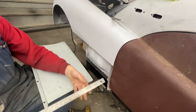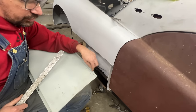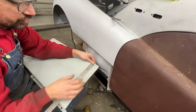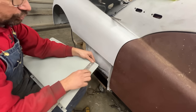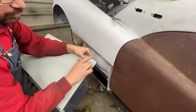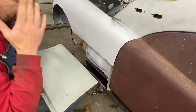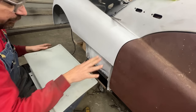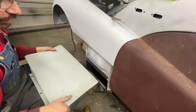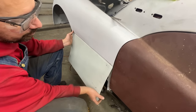It's cut off. I measured from where the old fender needs to overlap the patch - 12 and a quarter inches. Because I'm cautious I decided to cut it half an inch lower, so it should overlap our new patch a little bit more. We still have another half inch to cut. I cut 11 and 3 quarters instead of 12 and a quarter, and then I decided to test with the new patch - and I discovered a serious problem.